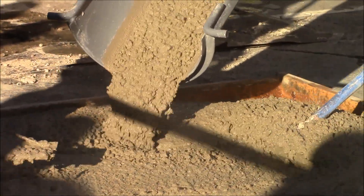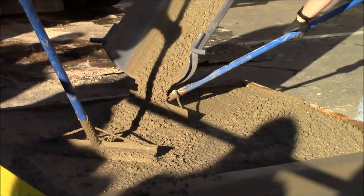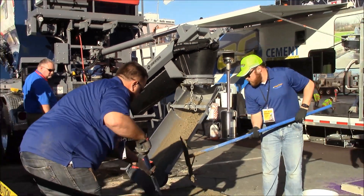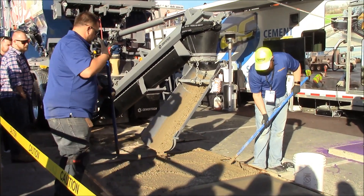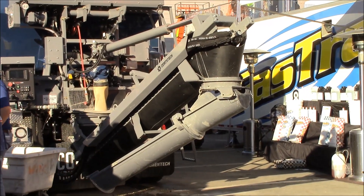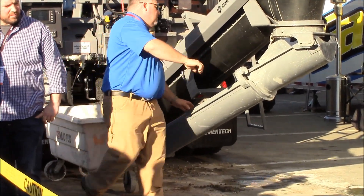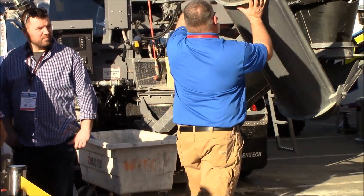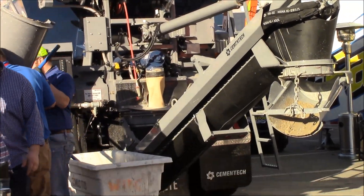This unit is available from the cement tank and is able to produce about a yard a minute at this rate. He's going to pour this in the form in about 30 seconds. We make these products in truck and trailer-mounted versions, and we make a stationary unit for those in the precasting business. As the owner, you can program how many gallons of water you want in the mix chamber and how many cycles you want it to go through for cleaning. That is the phase one cleaning process — Sean will pop the top open and wash it out with a garden hose.